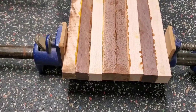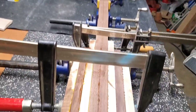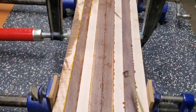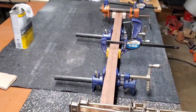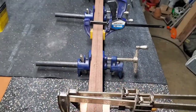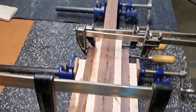Basically using some walnut and maple cutoffs from bows I've been building — stick around, might be fun. They're just three-quarter inch strips gang glued together with the clamps I had. I should end up with a good solid six-inch blade. I made it 54 inches — four inches shorter than a lot of standard paddles — but it'll have more girth in the handle since I have huge hands, so it'll be more comfortable.